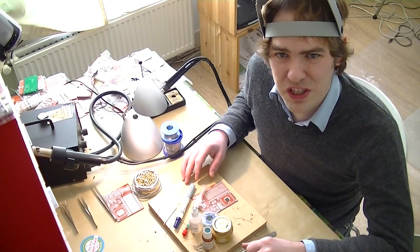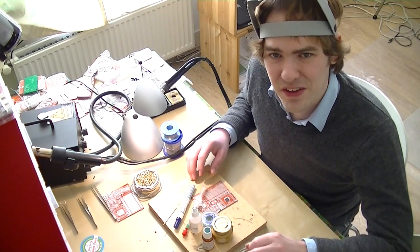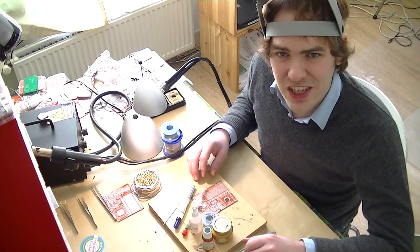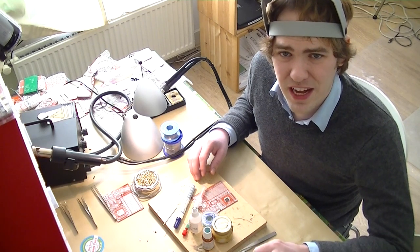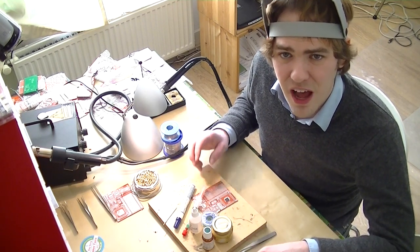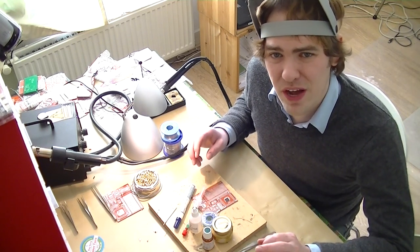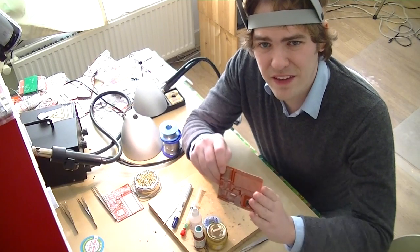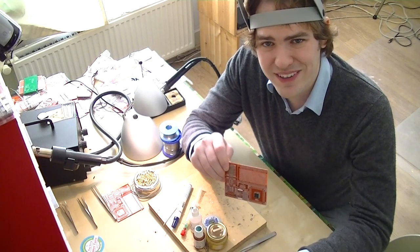Those are the four types of flux we had around the workshop: a liquid, something in a syringe, a paste, and a marker. Of the four, I think I still like the stuff in the syringe the most — it puts out the least fumes and the solder flows quite nicely. Shock's liquid flux really gave it a run for its money though; that solder joint was really nice and really clean the first time with no problems, even on a very difficult place to solder on a small pitch chip. So thank you for watching. We'll see you next week — I think we're going to show you how we do our free PCB Sunday packing, maybe something else. And one more thing: if you'd like this experimenter board with the PIC-18F soldered on it, post a comment below and we'll give it away to a random person tomorrow. Thanks for watching, see you next week.